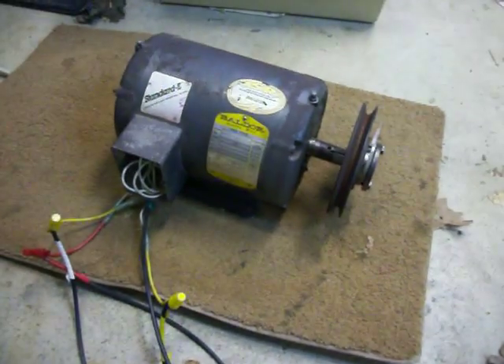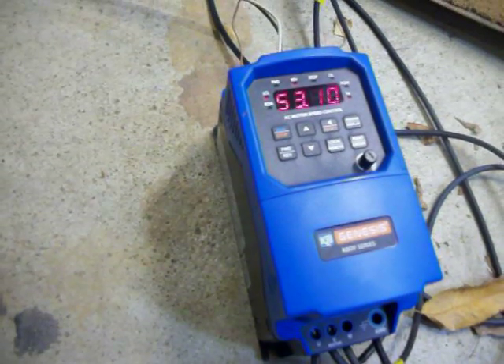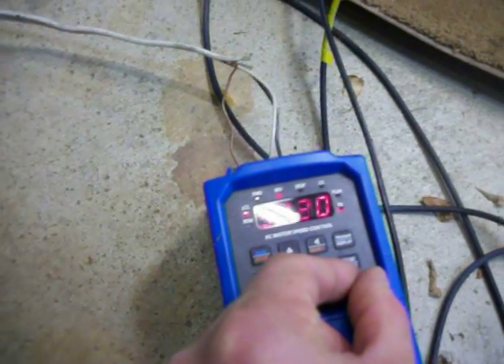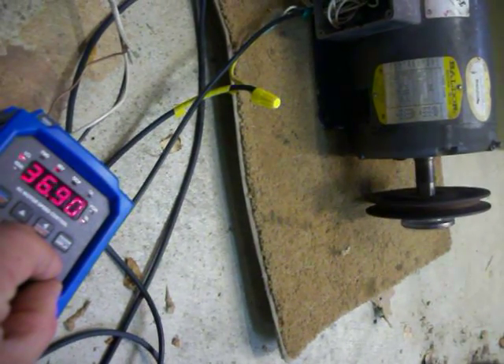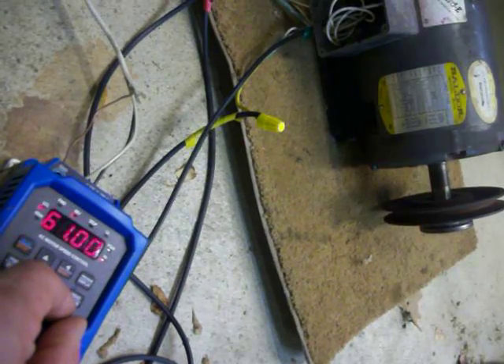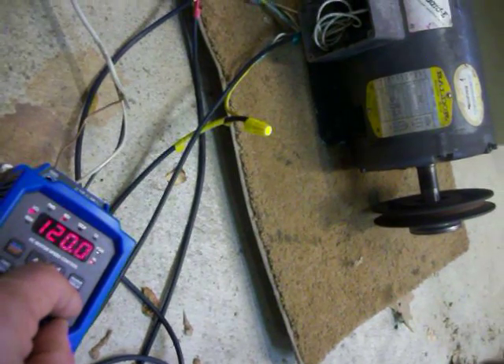If you hit the run button, you can see that it's set to go at 53 hertz, and if I adjust the potentiometer here I can take it down — listen to it go slower. You can take it all the way down to a crawl if you want to, or pump it up to 60 hertz. That would be the normal rated speed of the motor, but the electronics can push this thing up to 120 hertz as we've got it programmed right now — and it can really zoom.